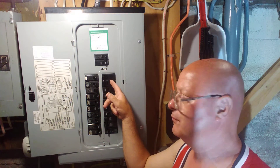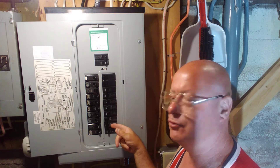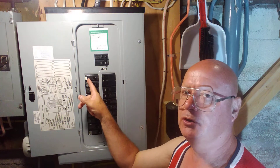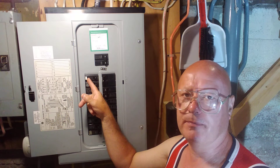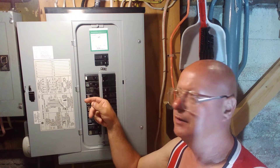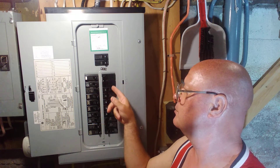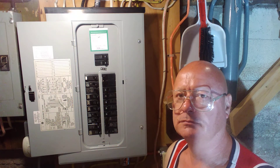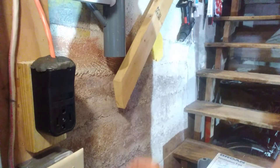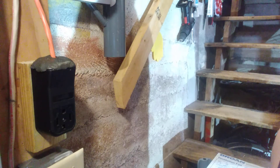So this is your 220/240 volt breaker, and these are your 120 volts, and this is another 220/240. This is called a GFI, and you use GFIs for your outside outlets, your outlets in the bathroom, and within six feet of the sink. This is the main — 240 here, 120 here and 120 here. Now this is a bigger 220/240 outlet — it has your two hot wires, a neutral, and a ground, and that would be for a larger welder. I hope you enjoyed it — peace, thanks for watching.